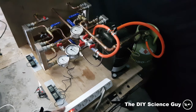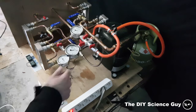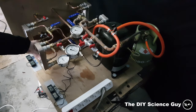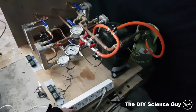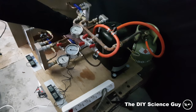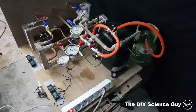When I tested the system it turned out that it pumps heat so fast from one reservoir to the other that I can't determine the right amount of refrigerant yet. Once the heat pump is installed to heat and cool my house the temperature will be stable and I can dial it in properly. A good functioning heat pump can have a coefficient of performance of around four, which means that with this one kilowatt compressor we could theoretically pump four kilowatts of heat — we'll see what the performance is when it's all operational.